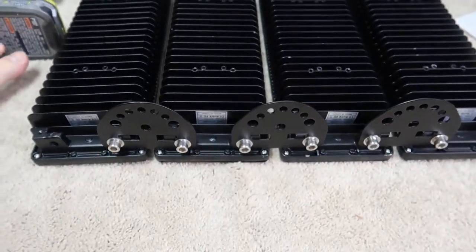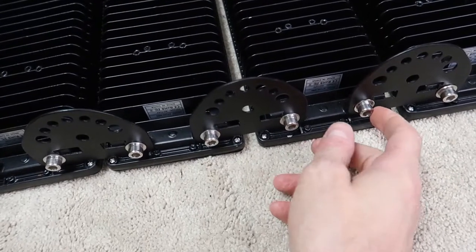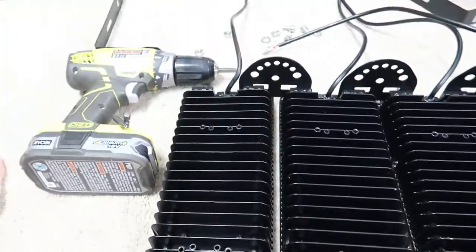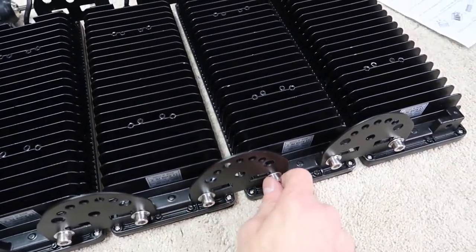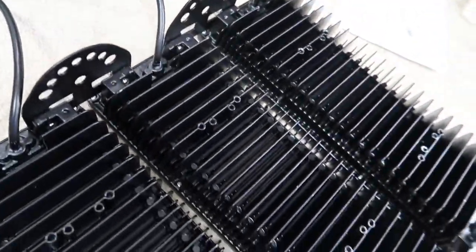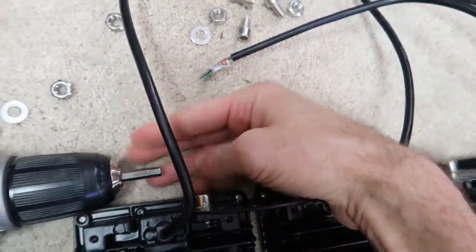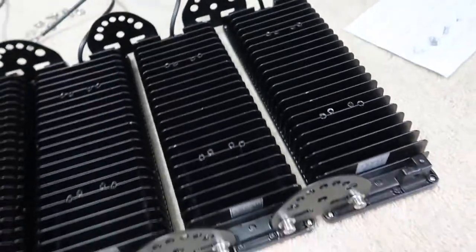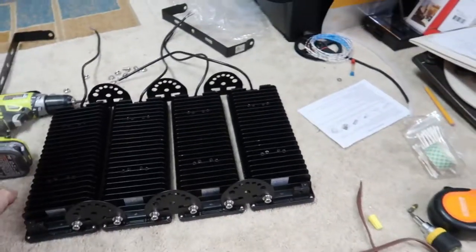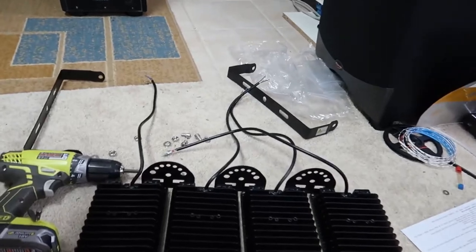We've got the brackets together. As some people noted, the tap holes are really tight because paint got into them, so I had to set my screw gun to max torque to blast through that. It probably would have been better to run a tap through some of them, but I didn't have a metric tap — these are 6mm screws, so you need a 6mm allen head. We got the four-gang bracket together and put the last mounting brackets on; now we'll wire them all together.